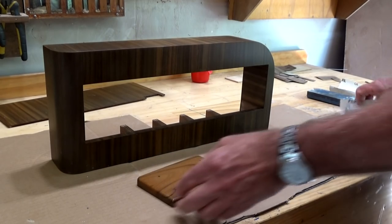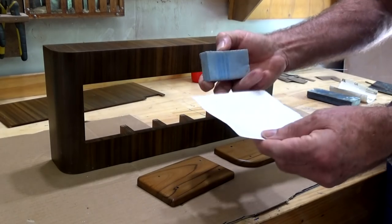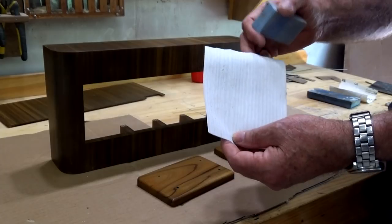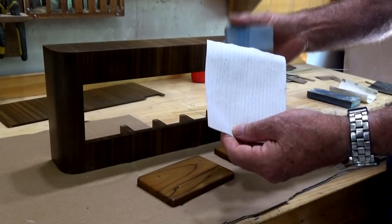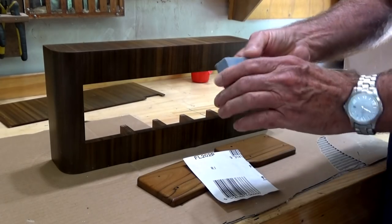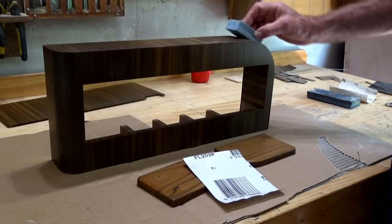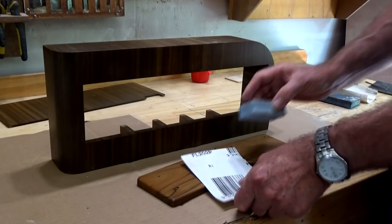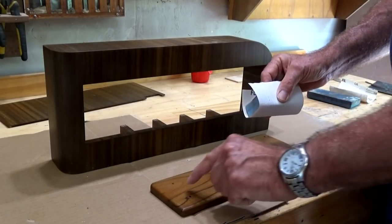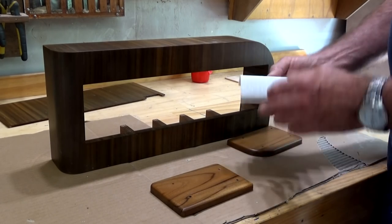So what I'm using here is a 360 grit no-fill type paper. It's got that white coating on it, and it also has a coating that helps to repel any of those sticky particles that you pick up from the paint. I'm also using a soft sanding block, mainly because it'll conform really well to the curves on this case here, but also a hard sanding block may tend to produce hard spots as you sand over it, and that can lead to depressions and scratches in the surface.